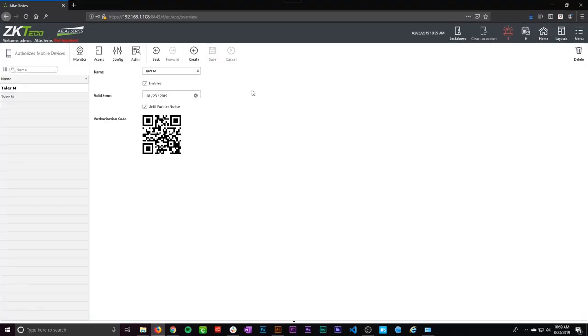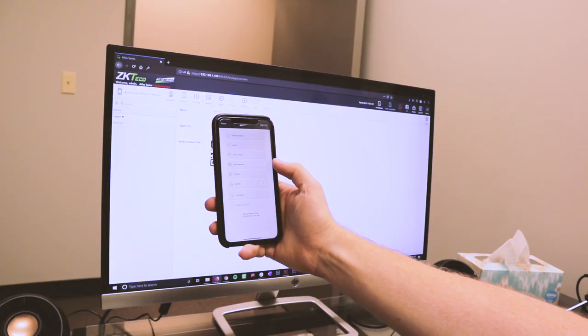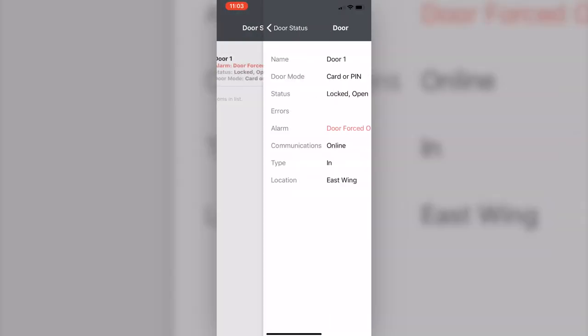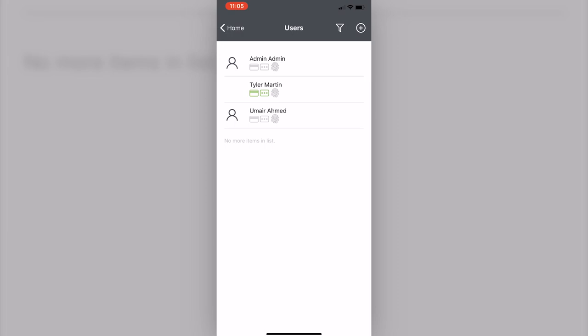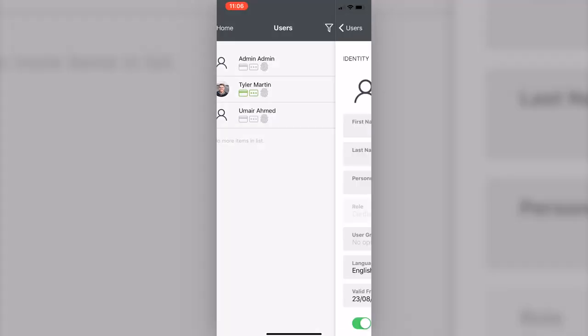As I mentioned earlier, you can also access your access control system through your cell phone with the app called Atlas. You have to enable this from the web interface and scan a QR code to register your mobile device, but once you do, you can manage your system directly from your phone. All I have to do is open up my phone, click door status, select my door, click the hand icon in the top right-hand corner, and this will allow me to override the system and grant momentary access. From your phone you can also view the live monitor, view existing users, edit their permissions, and even call them straight from the app. You can also add new users here if you need to.